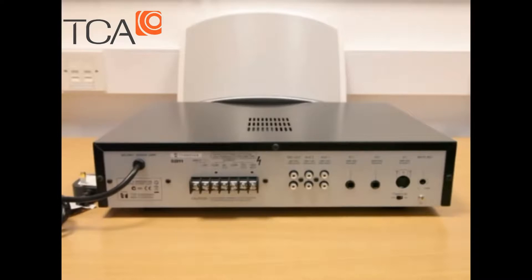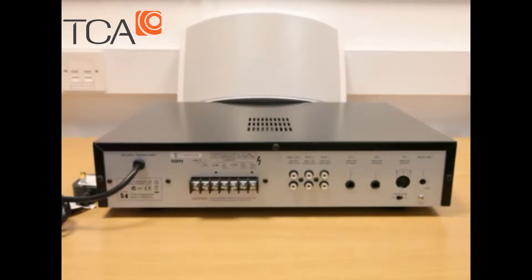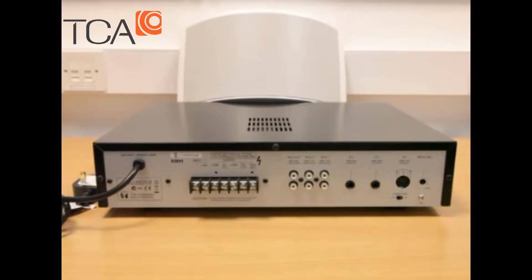Let's start with the output which wires to the loudspeakers on your system. What we need to make sure is that the speaker load on a 100V line system is rated 10-15% less than the amplifier — this is important. All 100V line speakers have wattage tappings which should be added up on a simple system or measured with an impedance meter on a larger system before connecting to the amplifier. In our case we have one 6 watt cabinet speaker, and we know that is less than the rating of the amplifier.